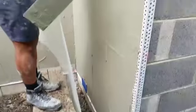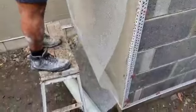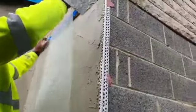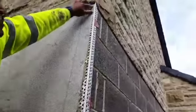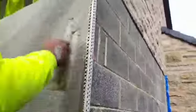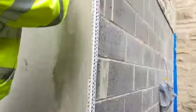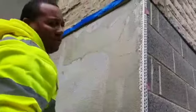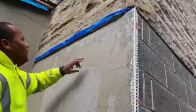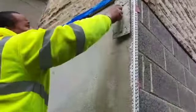And then what I'll do, I'll pull it up to the height I want it. See it unraveling by itself there. And what you want to do then is focus on the bead. You want it to overlap to the bead. So get it right to the top. It overlaps onto the bead just before it hits the spine, which is there. Yeah, you know what we do then? Got it in where I want it, just top it off, just to there. And then I'm going to work it on, starting from the top. Now, this is a bit that I've already cut, so it's a little bit off there. But I'll fill that in. To be fair, it won't really make any difference anyway, but I'll fill it in.